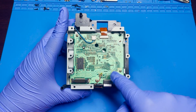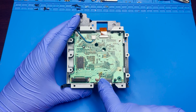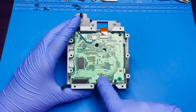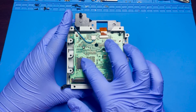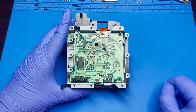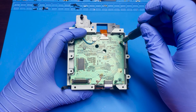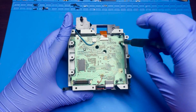There are also additional screws located down here. Once you remove all these cables, you should have access to the other side where the capacitors are located. We're going to remove these four screws and also remove these cables. The only ones that are going to be soldered on are these two. If they're an inconvenience, you can just desolder them and then put them back on later — that way you have complete access to the board and it's not moving around too much. That's actually what I'm going to do.